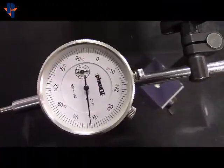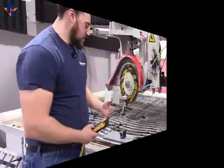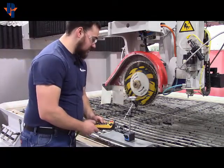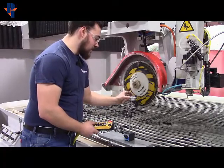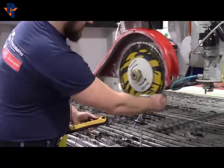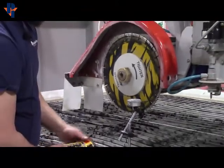Keep an eye on the little dial on the dial indicator so you're not off by a hundred thou or two hundred thou. You want to be about three-eighths of an inch below the flange, and you'll want to run your Y-axis until you get to zero. On the little dial it doesn't matter what you're on, just keep in mind what you are on. I always run negative and then pick a spot on the blade — this one's marked with a white dot. Re-zero it out.